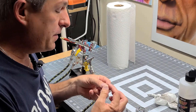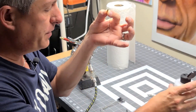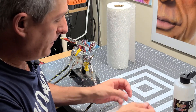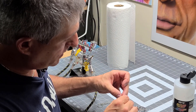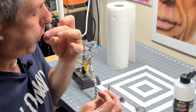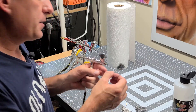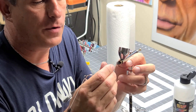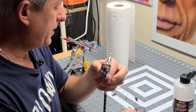I set that aside and do the same thing with my nozzle, whether it's small or big. I run a little reducer into my nozzle. Then I take my paper towel and twist it up into a point and run that into my nozzle a little bit. As you can see, more black paint. Give it a blow. There are a couple of brush sets out there — I don't use these much, but just letting you know they're available. You can run that in there a few times to make sure it's all cleaned out. I just use the paper towel — I find it to be quicker and I think it does a more thorough job.